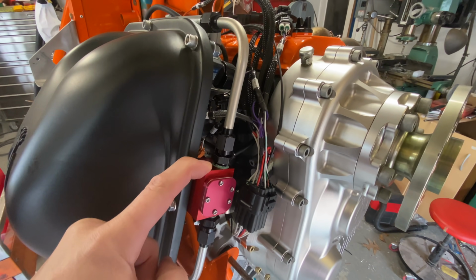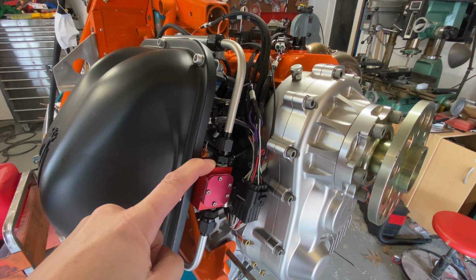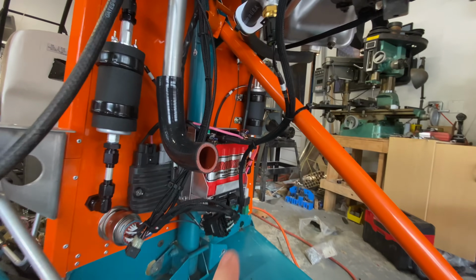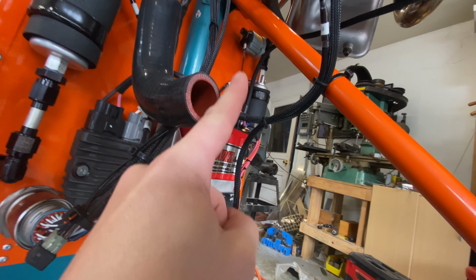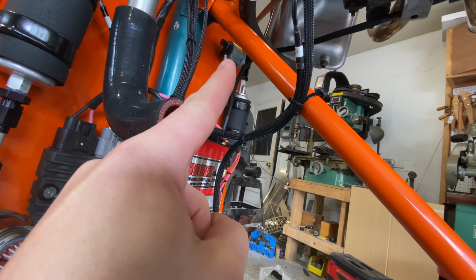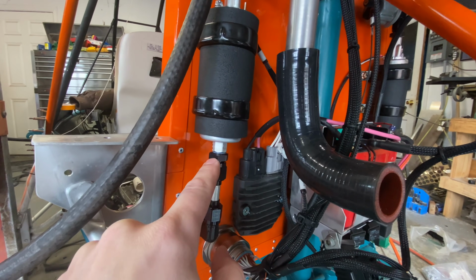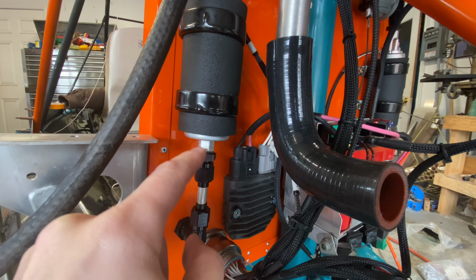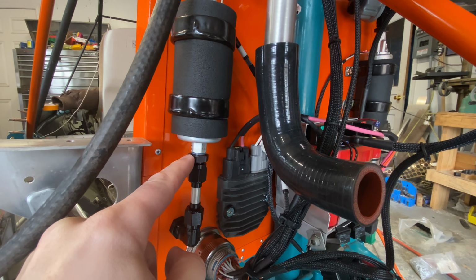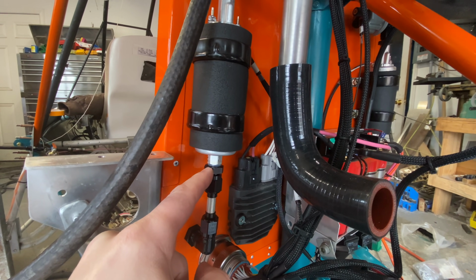These are pipe threads. Those I had a little bit of leakage around and I needed to put some thread sealant on. Similarly, our fuel pressure guy, which is over there, is also a pipe thread. He needed a little bit of that same stuff. And then I had put copper crush washers on these, which are straight metric 10 threads that actually use a crush washer to seal. I'd put copper crush washers on them and that did not work.